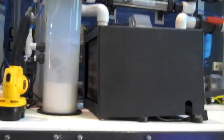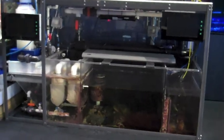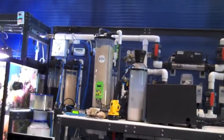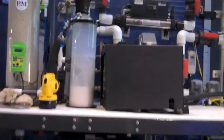Here's a chiller — it's a half-horsepower chiller. The total system, including our refugium sump of about 200 gallons, is about 900 gallons total. Normally it would take a one-horsepower chiller, but because this room is air conditioned and open air so everything can breathe, I'm able to get away with a smaller chiller. So that's around 1,500 watts on the lighting system, plus all the heat it's dumping into the aquarium, plus the electrical juice to run a half-horsepower chiller. It adds up to dollars.